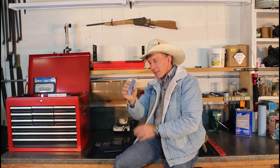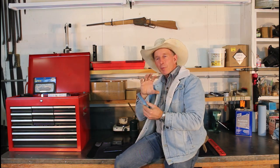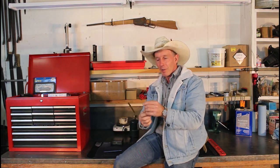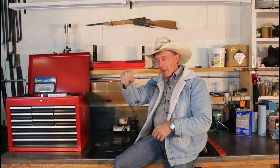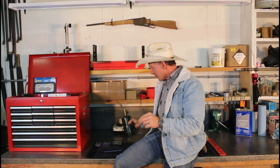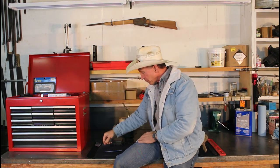I brought some examples from some of the tempering because they turned out really pretty. These pieces of steel here we were tempering to a certain color. If you know about tempering, you understand that as we heat metal an oxidation layer forms on it, and depending on how hot we're getting the metal, it changes colors through a spectrum. We were searching for this really dark blue color that comes right after a really pretty purple color. Here's a piece of oil hardening rod that we held in wire and heated up, just using little propane torches for the tempering. Really beautiful stuff.